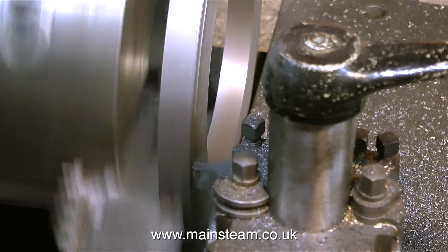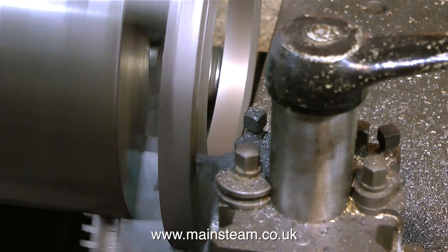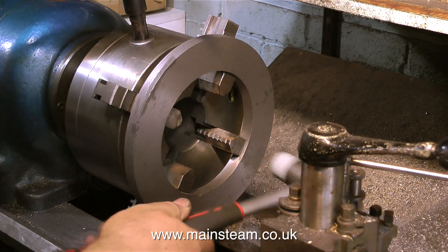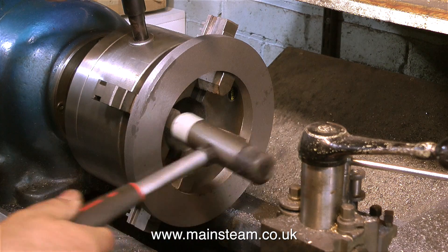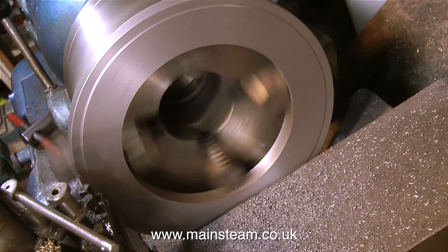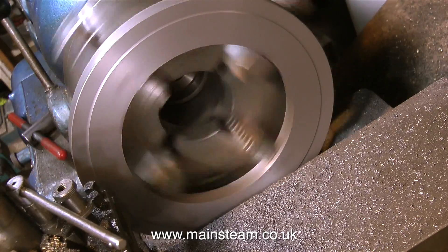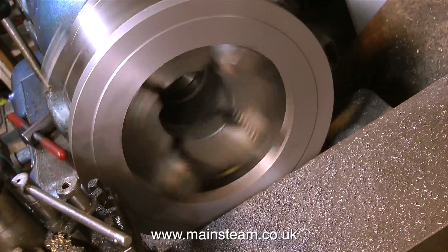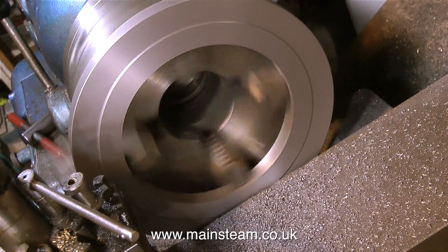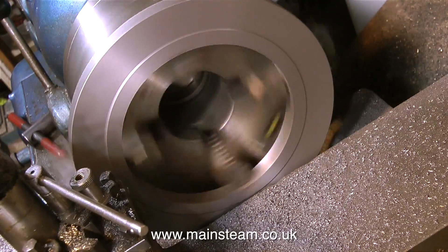With the inside ring turned to the correct diameter, all I need to do now is machine the front face of the ring, using the same round nose tool as before. Then the final job is to turn the ring the other way around in the chuck and tap it into position with the soft hammer. Using the round nose tool, I face the other side. How thick is this? I don't really know — I would think it's about 5/8 of an inch. This is definitely not a precision item, so I'm not going to waste time using a micrometer. I'm just using my eye — when it looks right, it is right.